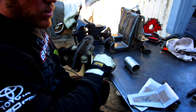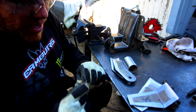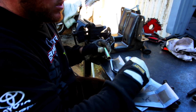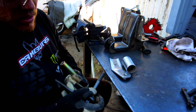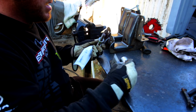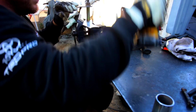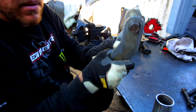That's great. So you're gonna want to do the same kind of thing you did on the shackle hangers. I'm using the same little washer piece I cut myself, super thin. I just couldn't find a washer thin enough, so this will do what I need it to do. So you take your shackle bolt, you stick it through said shackle hanger piece with the sleeve, with the little washer you got, and you put the other side on and you bolt them together. Doesn't have to be insanely tight. Again, basically just tight enough to make sure this thing's connected.